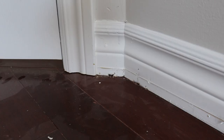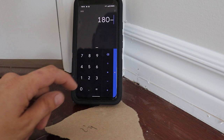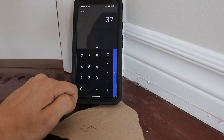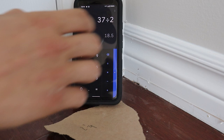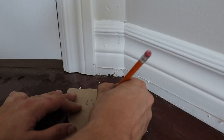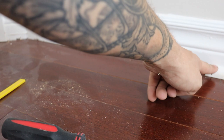It's like 142 or 143 degrees. This is where we gotta do some math: 180 degrees minus 143 equals 37. Now you can't get to 37 degrees on your chop saw, so you divide that by two — eighteen and a half. That's how many degrees to set the angle. So we're gonna have to cut these at 18.5 degrees.